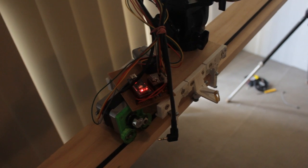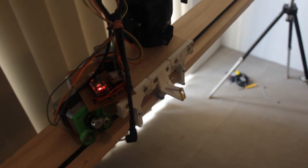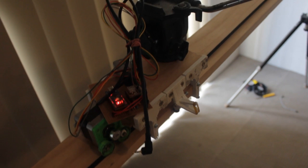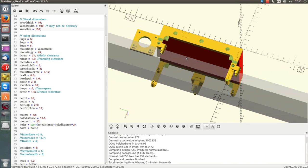In order to make it easily customizable, all the models for these 3D printed parts are parametric. So if you don't want to use this particular piece of timber, or you want to use different bearings, you just throw in different dimensions and it should pump out those models for you. You might notice this model is slightly different to what you saw in the video. The early iteration had each part attached to the piece of timber separately; I've just combined these into one part.